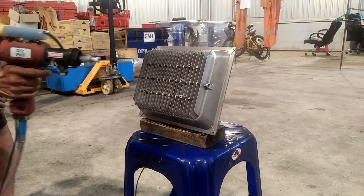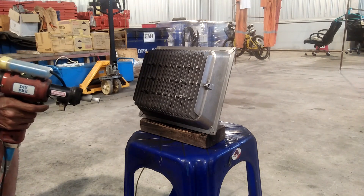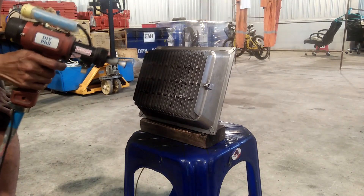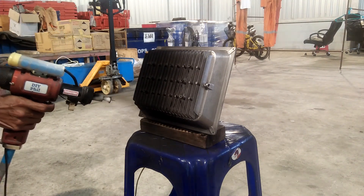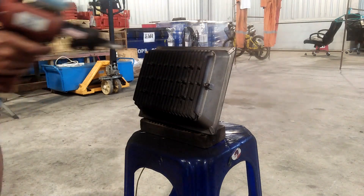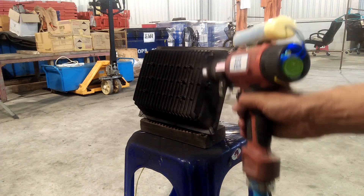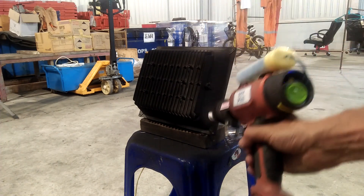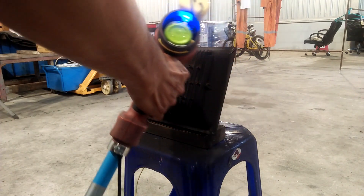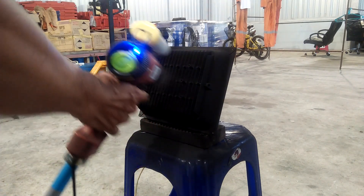I set the supply input to the high voltage generator at 5 volts for a relatively low kV. During the first pass, the inner corners are not coated with powder. I tried a technique I heard somewhere that uses a wide nozzle tip — they say not to spray directly at the spot but to spray at an angle, but that does not work for me.